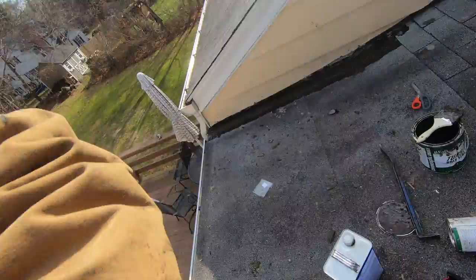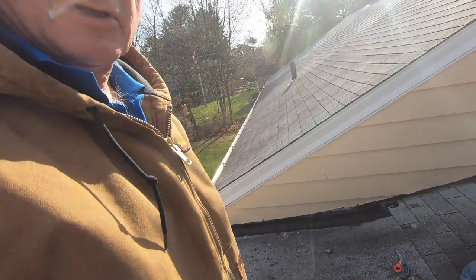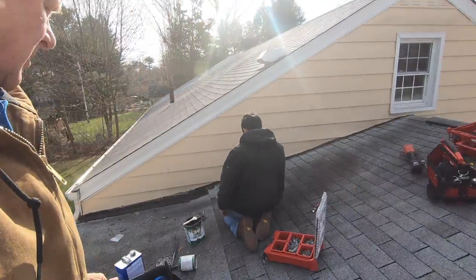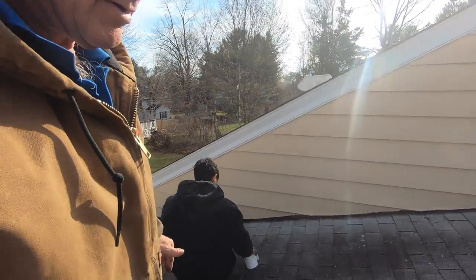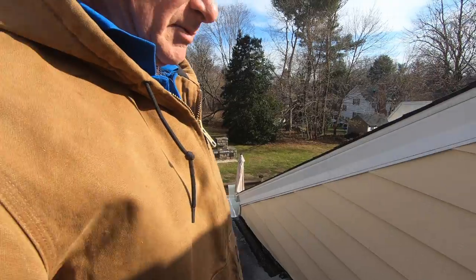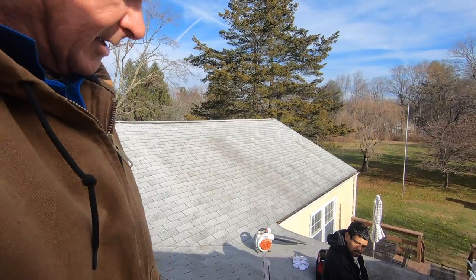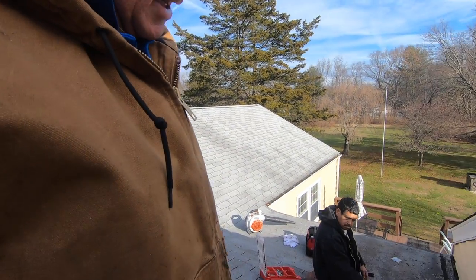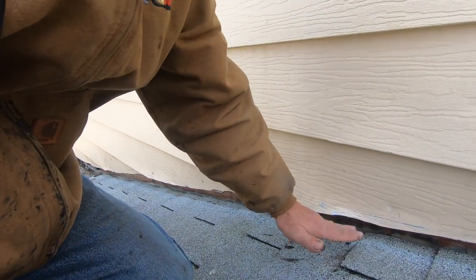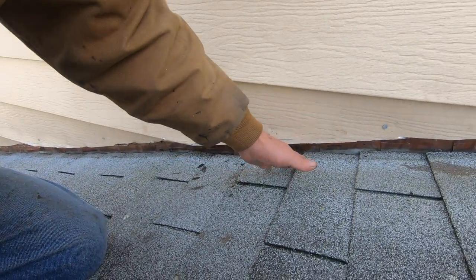The flashing from this roof is done — the roof is now connected to the flashing. That's how you fix the transition between a rubber roof and a metal flashing. It's a very common problem. So again: clean the dirt off the flashing and the shingles, then remove the siding, cut the siding up higher — in this case I have it over an inch, inch and a half — and clean the flashing.